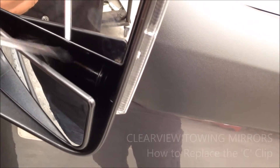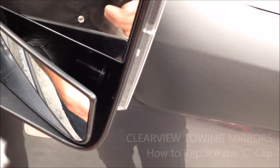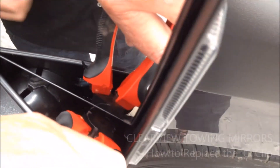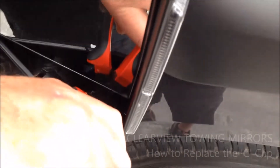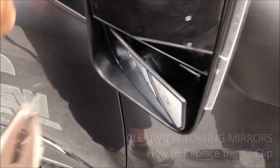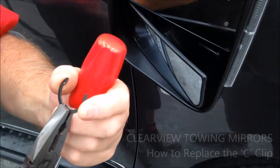On the end of the shaft, and you can take it off by simply putting a pair of pliers down in there, grabbing the circlip, holding it firmly, and pulling it off like that. To reverse it, you just go the other way.